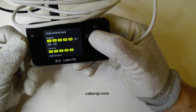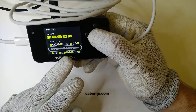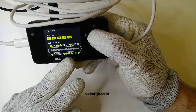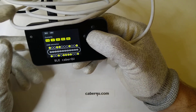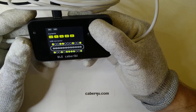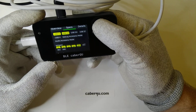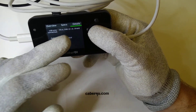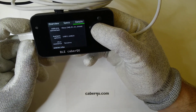If we take a look at the USB connector pinout, we can see that besides VBUS and Ground there is D-plus and D-minus for USB 2 connected, as well as the CC1 and CC2 pins that are needed for the power delivery negotiation and communication from your laptop to your charger and the cable itself. Going into the details: it's VBUS, Ground, D-plus, D-minus, and Shield. Shield is always good to have connected, but if you only want to use it for charging it honestly doesn't matter.